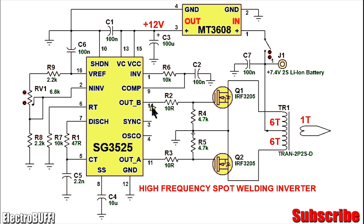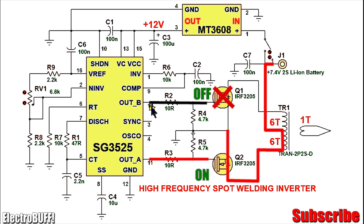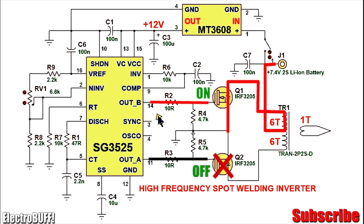The working is simple. The outputs at pins 11 and 14 are complementary — when 11 is high, 14 is low, and vice versa. In the first scenario, pin 11 is high and 14 is low, so there will be about 12V at the gate of MOSFET Q2, biasing it to conduct. This permits current to flow from the positive of the battery, through the primary winding, through MOSFET Q2 and to ground. In the second stage, pin 11 goes low and pin 14 goes high, so Q2 turns off but Q1 turns on. Current now flows from the positive of the battery through the upper winding, through MOSFET Q1 and to ground. This completes one oscillation, repeating about 32,000 times per second.